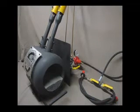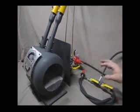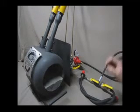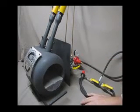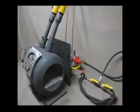If you do smell gas, I suggest doing a leak detection test as described in the operating manual. What that entails is a little soapy water in a spray bottle. You'll spray it all over the connectors and see where little bubbles occur, and then you'll tighten those connectors. A 14 and a 17 millimeter wrench would do that for you perfectly.